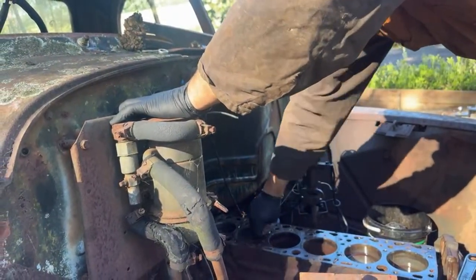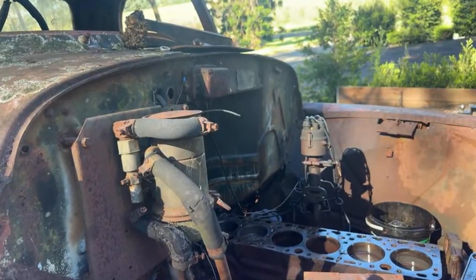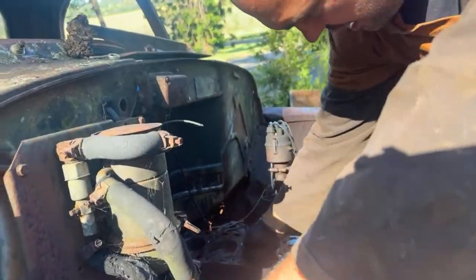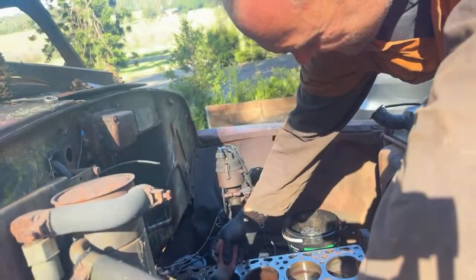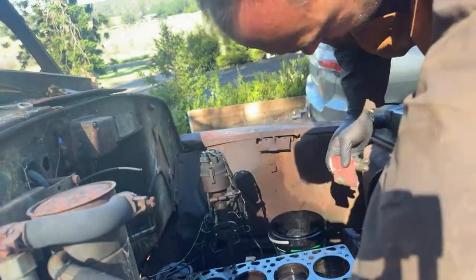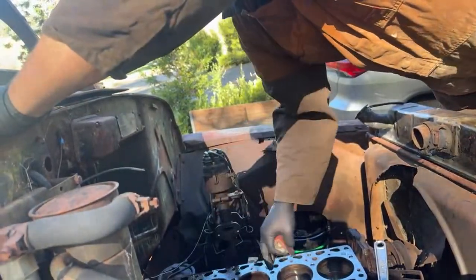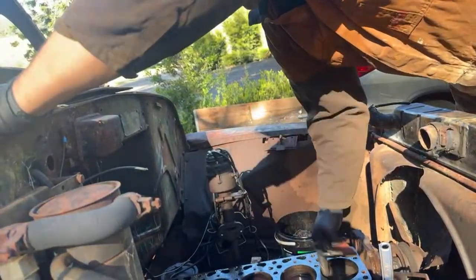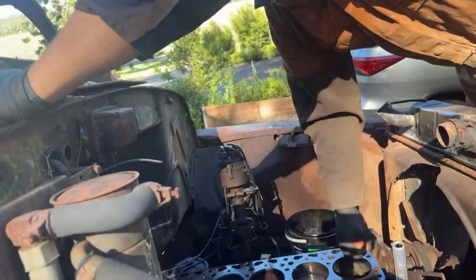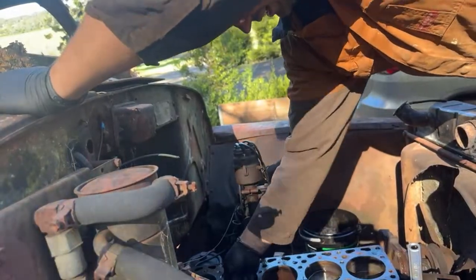Bruce said, what you working on today? It's an R170 Inter. Oh, elephant hauler actually, elephant truck. I used to haul all the elephants to the circus and between zoos and whatever they had set up. But it's sat for, I don't know, since the 60s, probably in the one spot, maybe later, 70s. Had the oil fill cap off it, so she filled right up with water. Every pot was full of water, which means you only ever get one valve open if it got through the carby. So I'd say it filled up past the rings and then seized and not let it back out.